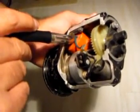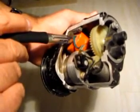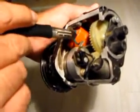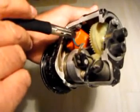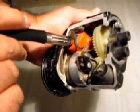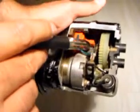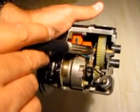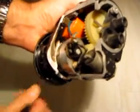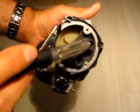And here we have two coils of wire. We have a primary coil - it's a relatively small number of coils - and this is part of the primary circuit. And then on the outside there is a very large number of very fine wires. The coil converts the low voltage to a high voltage, and the high voltage comes out of the coil through this contact point and through onto this wheel and out along this thing called the finger to one of the four spark plug wires.